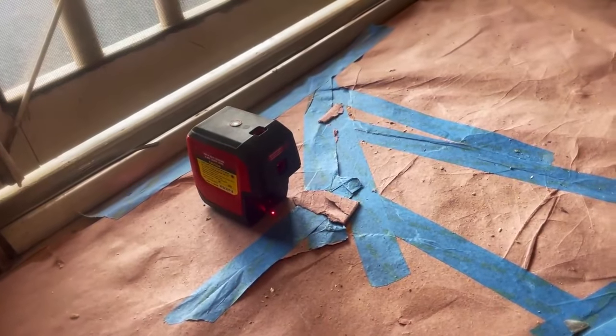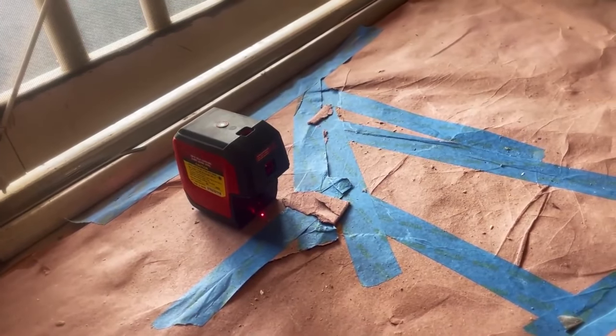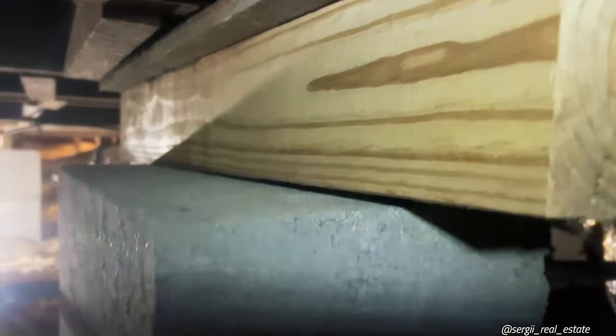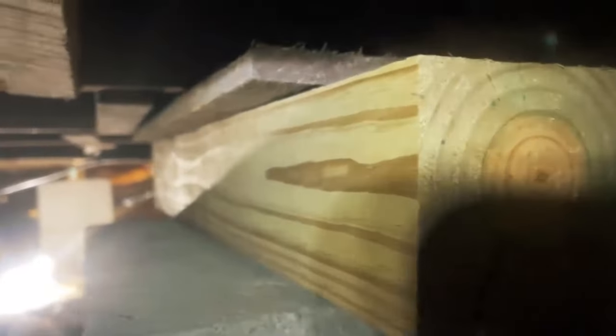The proper way to lift floors, based on my contractor's work, is: determine the lowest spots using a laser and a large level tool, move underneath the house to pour slabs in the spots where floors need to be lifted, then build piers there out of blocks and wood, gradually shimming from spot to spot. On my next project where I need to lift floors, I'll try to make a video with step-by-step instructions on how to do this properly.